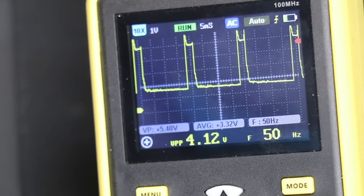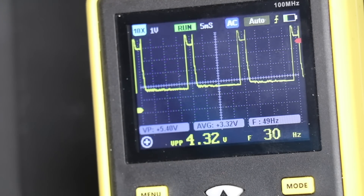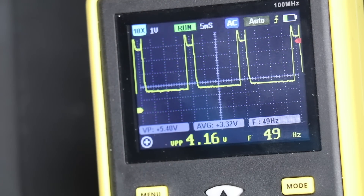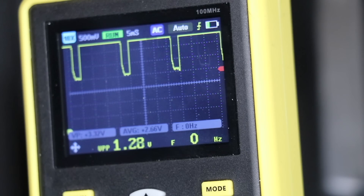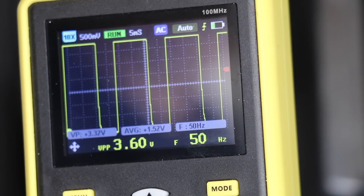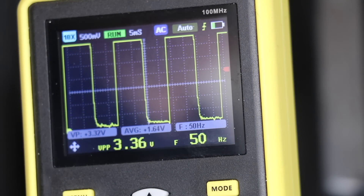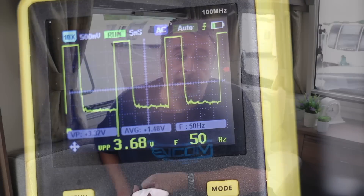If it thinks the battery is full, it will reduce the width of the pulses, and so on. This constant changing of widths of each pulse is known as modulating — this is where we get the term pulse width modulation. On the oscilloscope display, the spikes are not the power going into the battery; it's the flat line at the bottom, because the voltage is pulled down as the controller sends charge. The pause between each pulse is actually the peaks. This first example shows a charged battery with no charge going through. This next example shows the battery needing some charge — watch what happens when I switch on the caravan lights; the voltage drops, triggering the controller to send charge, and you should clearly see the width of the pulse change.